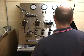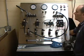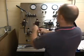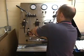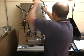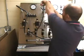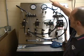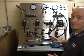From here what I want to do is run a hose from the relief valve's other number 1 up to one of the inline pressure gauges. In the way this is set up right here, the system's pressure and the inline pressure gauge will absolutely be the same.